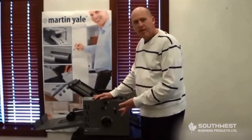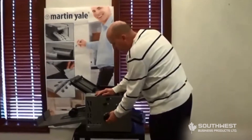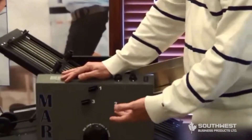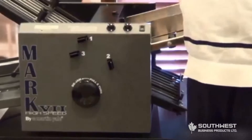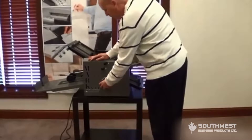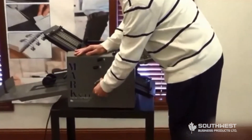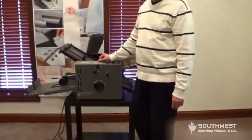There is also a de-jam handle installed on the side of the machine. The de-jam handle is freewheeling so that while the machine is running it doesn't spin and cause any danger to anyone wearing a tie or with long hair. To use the de-jam handle, you simply pull out on it and turn — it engages the rollers and de-jams whatever may be caught in the roller package.